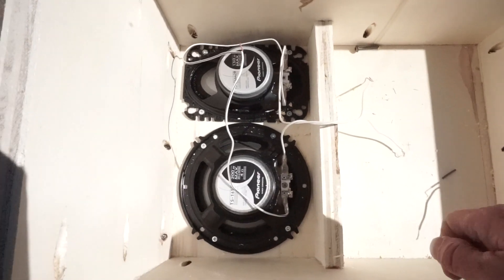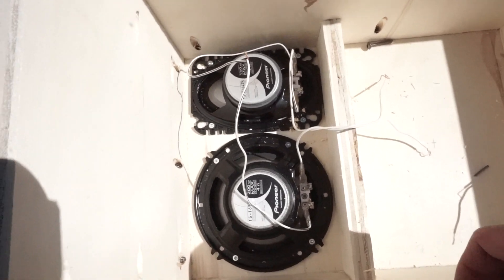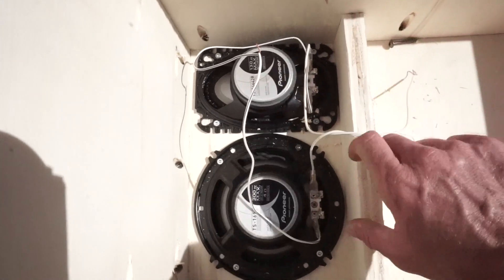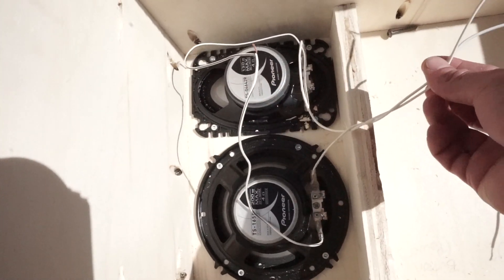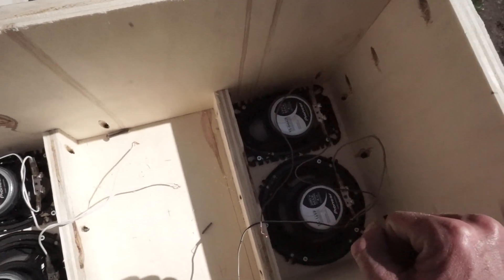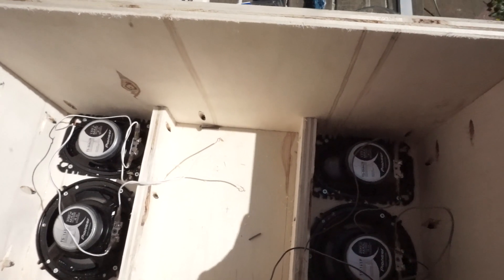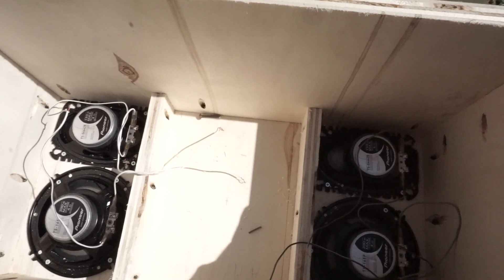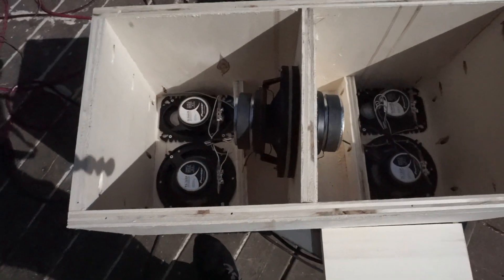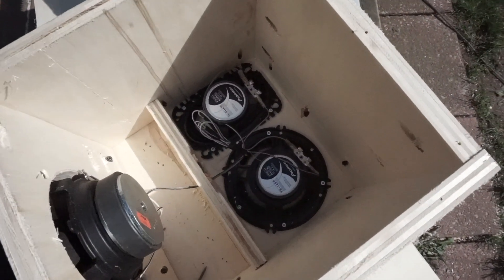So we've got our speakers in, and as you can see we've hooked them up in series. The amp we have runs best at 8 ohms — sounds the best. These are 4 ohm speakers and we have two of them, so power to ground and then power and ground, same over here — that's going to give us 8 ohms. I've tested it between 4 ohms and 8 ohms, and they are just way snappier with the 8 ohms — just sounds easily twice as good. You can see we've got our speakers all wired up and soldered, everything is all taped.